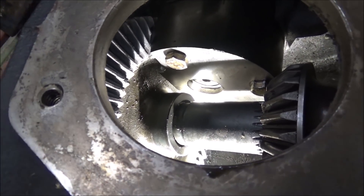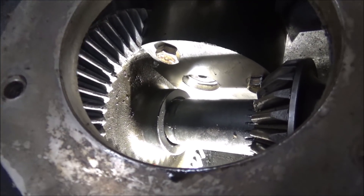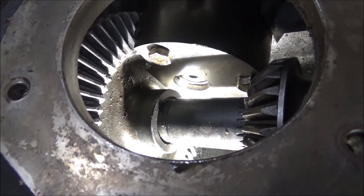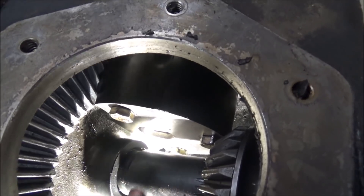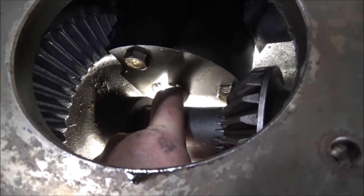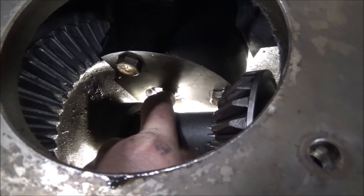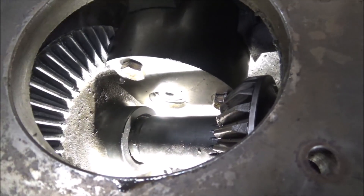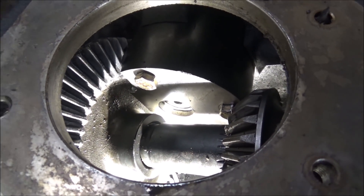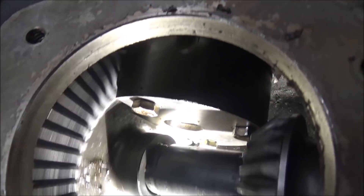Hopefully you can see the clearance where I've got that tab going out into the gear to give extra support around the bearing. It's not real thick over here, and you can see the flat washer under the race in there so you've got something to hammer on and knock the race out in future repair work. But other than that, it's all together.